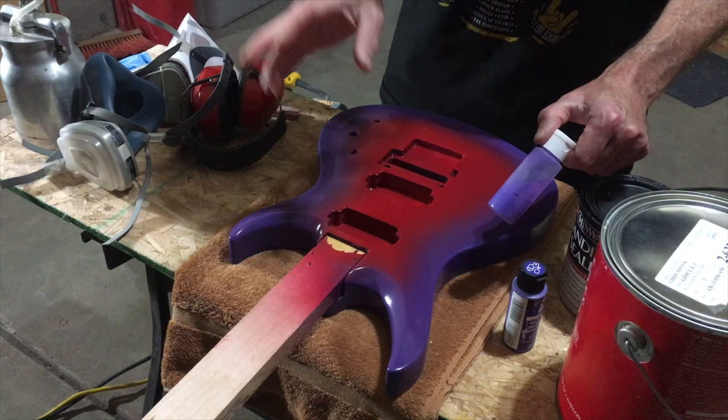And I've used quite a few water-based lacquers, acrylic lacquers before, from several different manufacturers. I've used Hydrocoat Resisthane, and I've used Target Coatings EM6000. And those are all really good products. But this one in particular, this General Finishes Enduro Pre-Cat Lacquer, I found once it's dried and thoroughly cured, it is a much, much harder product. It has far better scuff and scratch resistance than the other products.